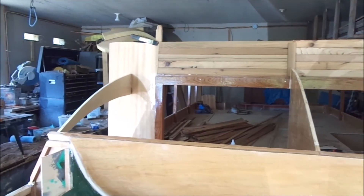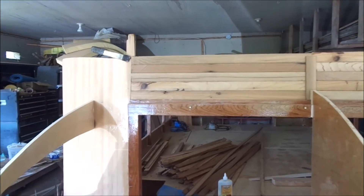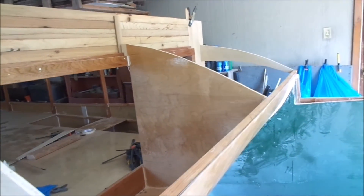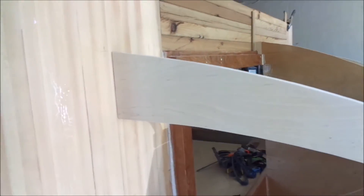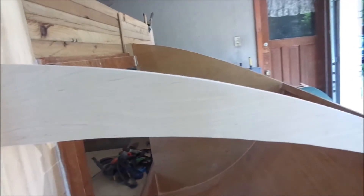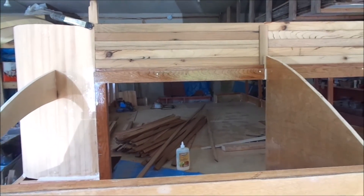I'm now starting work on the deck at the front. You can see I've got one horizontal panel there — the strips are glued together, still need sanding and epoxy and glass, so it's just there temporarily. Meanwhile I'm working on the support mechanism for the deck and wanted to have a bit of an arch to it — figuring it out as I go. I finally have the arch completed on both starboard and port side; next I'll epoxy them, mount them, and then run strips across to support the main deck strips.